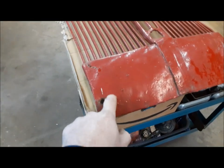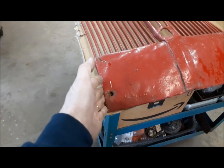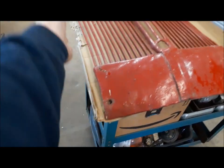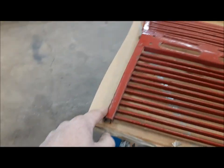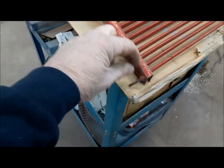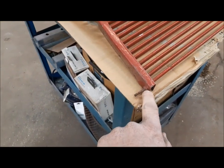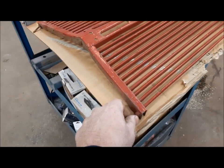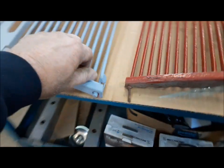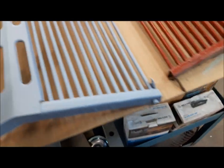Number one, the early 2N grille at the bottom where it bolts to the dog leg is different, and the top of it is different. It would have had little pins welded in here — I guess they've gotten busted off and replaced with machine screws, but that's basically how they were held in. Then the 8N has these latches, so you can pivot the grille out — kind of like a single-hung window in your house — to clean the radiator.